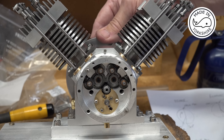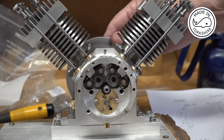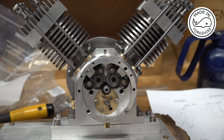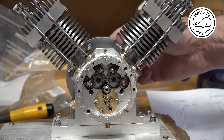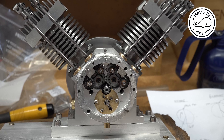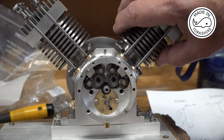Continuing with the cycle - we're sucking in fuel on the intake. The intake should close 40 degrees after bottom dead centre - it's pretty close, it's on the sort of 50 degree mark maybe. It's a bit difficult with these gears getting it precise, but it's what it is really. So it's close. What I need to do is replicate the same thing on this cylinder, but I'll do that bit off camera.